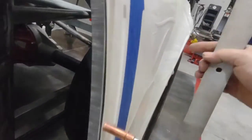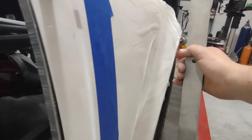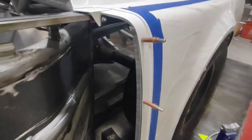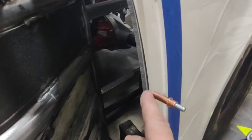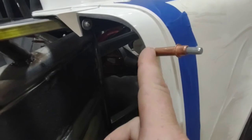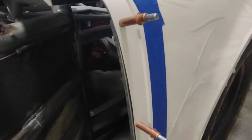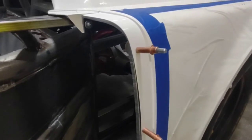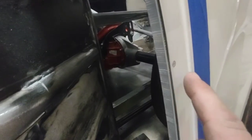Having it kicked out at the bottom, it'll expose some of the middle of the tire before it goes to the wheel well, because this has got some flare built into it over the tire — and the whole thing has a good look. Also, if I were to use regular rivets here it's going to keep that door humped up. I can install it using the same rivets holding the door to the quarter panel, but that's a pain to get located and drill all those holes while riveting through three panels. Instead I'm going to use countersunk rivets on those.